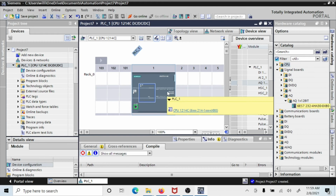So when I load the processor, I'll load it with that slot active. Now if you load it and it doesn't have that slot active, it'll give you an error. So you definitely want to get it exactly right. You also have to have the right version. You also have to have the Ethernet port set up, and that's this little guy right here. It's a little green square.